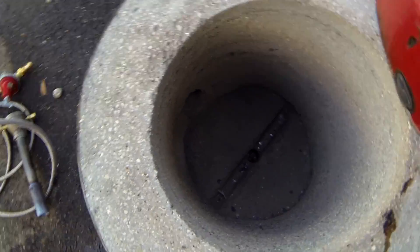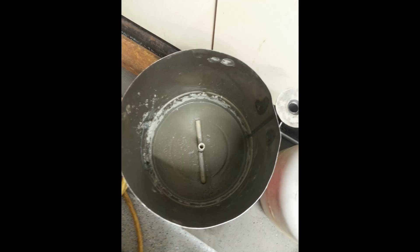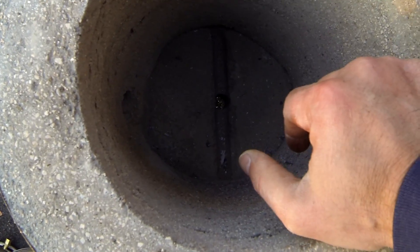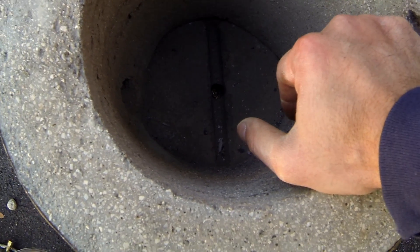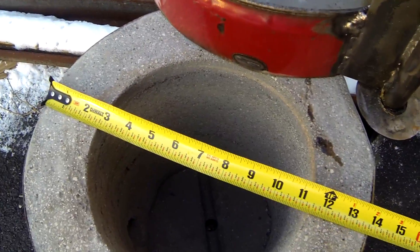On the bottom I took an old broomstick and formed two passages at an angle, so that if I had a crucible failure it would leak down into the catch pan underneath and wouldn't make a mess of the furnace.